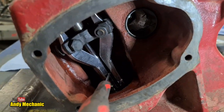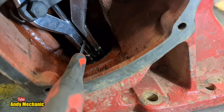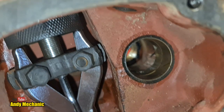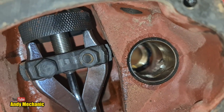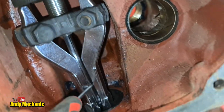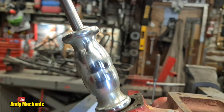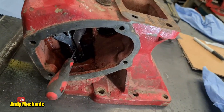I wish I had a slightly smaller puller, but it's extremely tight down there. I'll just turn the torch on for you. There you go. Yes, and it's such a small bearing that I can't get the collar at the top over the three little arms to hold them out. So I've just wedged a screwdriver in, and we have the slide hammer all plumbed up, but it's very, very tight. So I'll stick it in the tripod.